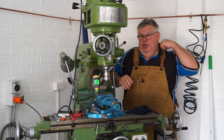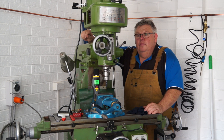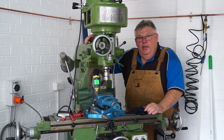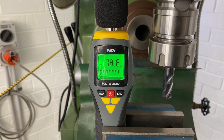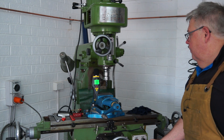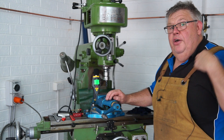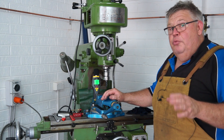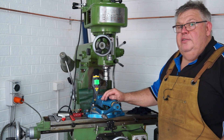Let's turn it on and see if we can see a change in noise. You'll be able to pick up the sound on my lapel microphone of the horizontal spindle running. It's a big improvement on what it was. If we look at the dB meter, we're roughly bouncing around 78 to 79 dB — it sounds a lot happier. To give you an idea of ambient sound in my workshop, just standing here idle with the roller door open and the rotary phase converter running, we're at 57 to 58 dB.